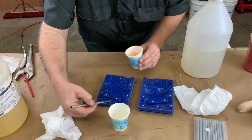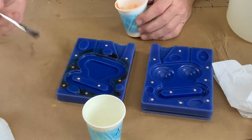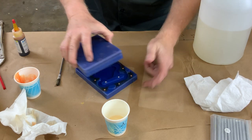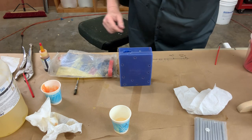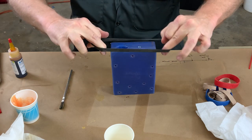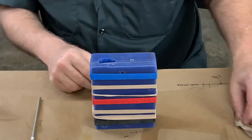The reason I'm pre-wetting is that with rigid tools, no matter how tight they are, they don't necessarily seal up 100% around the parting line. Basically, I'm just creating a gasket — but making the gasket out of the same material as the casting. Once that's done, into the acetone the brush goes. It's not going to be ruined — it'll be almost as good as new. Now, you know how I've preached against big, heavy, strong rubber bands because they can distort a mold — but there's no possibility of distorting this rigid mold, so it wants a nice strong rubber band. We're going with big, heavy, strong rubber bands, putting a lot of force on there. We want this mold to close as tightly as we can get it.